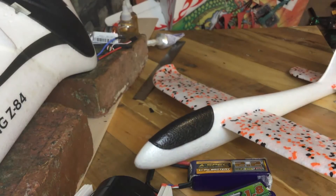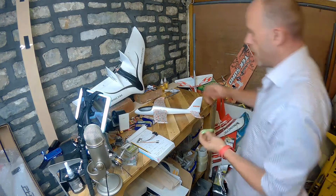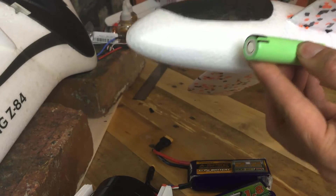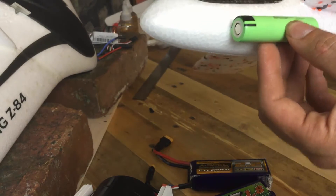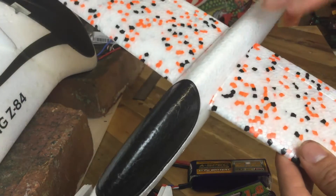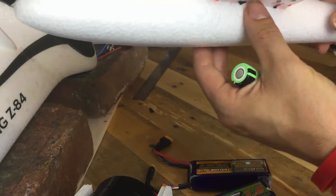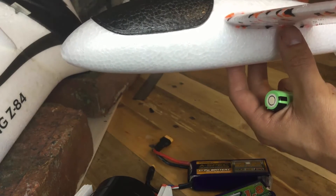What do you make of that? What would you do in this instance? I've got two batteries I'd like to fit in there — I won't be using an 18650 battery, I've got two smaller batteries which I'll make into a 2S battery rated up to about 2000 mAh. I was going to fit that wherever I could, and in the wings themselves I'll install two servos. I am a little bit concerned about the CG point being so far back on the wing.